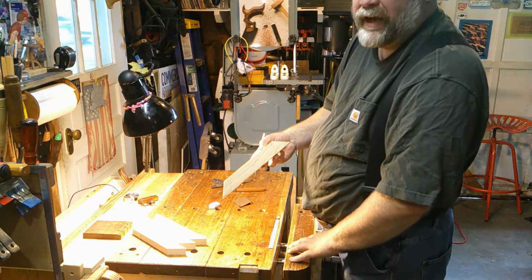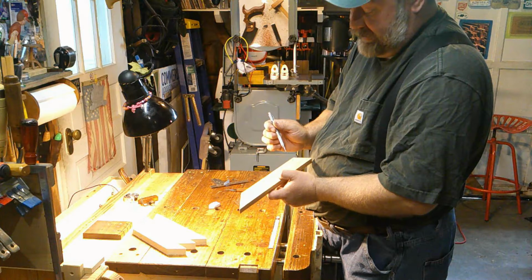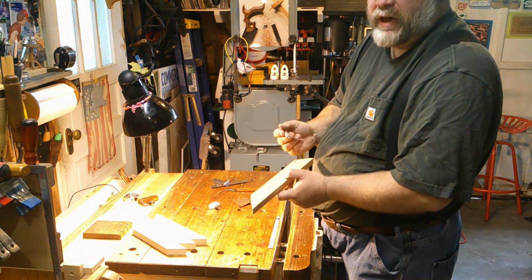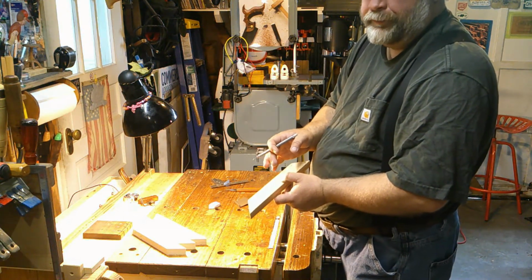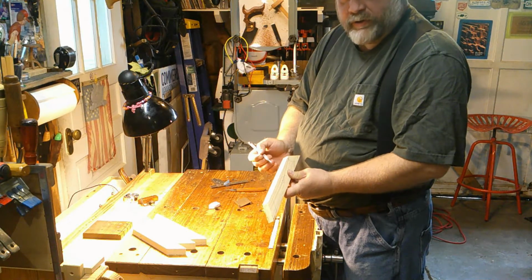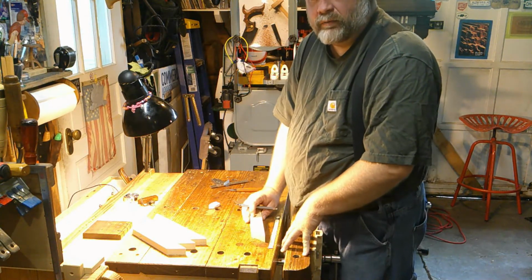Right there you'll see the back cut for the dovetail part. Now the positive of that, this is the negative, will be the negative when I cut this out. The positive of that we will scribe out onto the piece itself, because each one of these is going to be different in some way, shape, or form. So we do each piece individually so that it ensures a tight fit. What we want to do too, for sawing by hand, because that's what we'll have to do, is bring these knife lines up and across. That way, when we start to saw, we have a line that we can reference off of. Okay, I'll lay the rest of these out and we'll see how it goes.